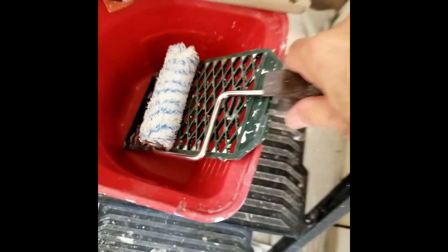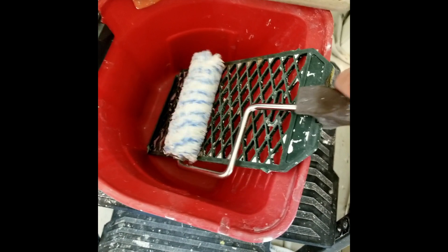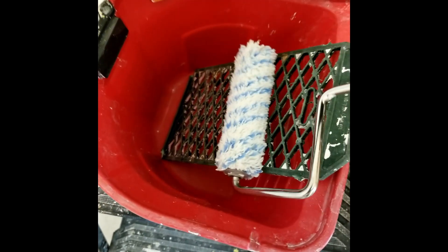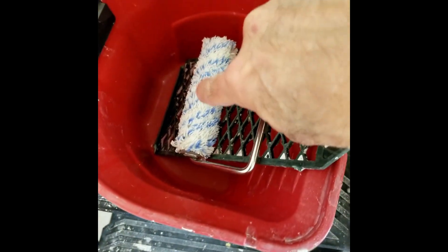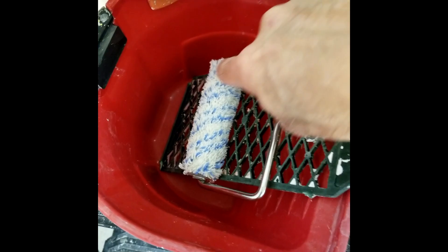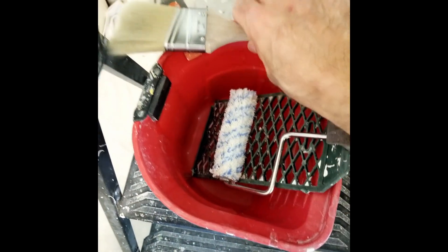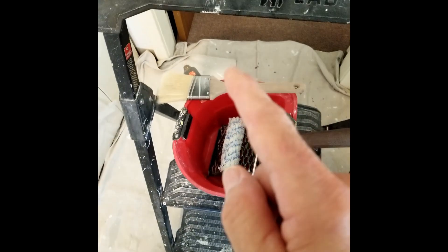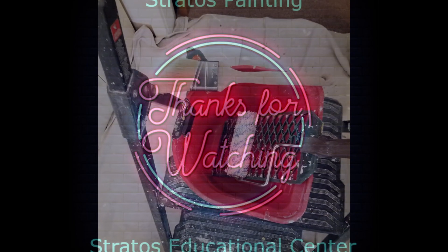I don't want any paint on this end — I want all the paint on this end. So when you load the roller, make sure you roll it on an angle. That's the trick of using the roller and cut bucket setup. Roll it this way, and as you're rolling you'll see I'm kind of dragging it, which gets excess paint off and leaves an ample amount from here to here — that's where I want it. Now I'm going to show you how to cut a corner, in this case the ceiling, which will be in the second video. Thanks for watching.